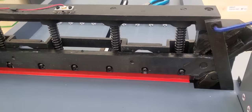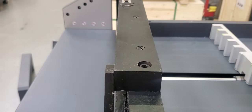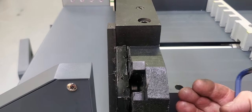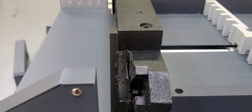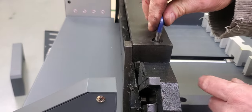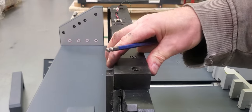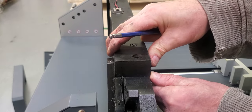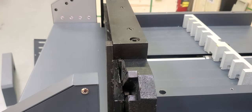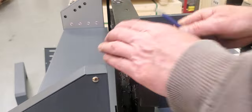Before tightening fully, refer to your pictures to see how this was lined up. If it was perfectly flush, just get it perfectly flush. The clamp may be hanging over just a hair — that's why you take pictures from different angles, both sides, and get it back exactly the same before tightening down, because it will affect your laser light. Loosen just a quarter turn on each side to give yourself control over positioning, then get them snugged down once it's in the right spot.